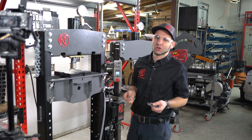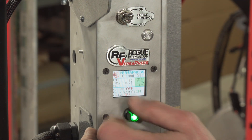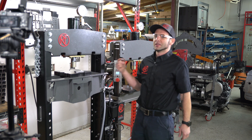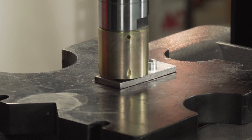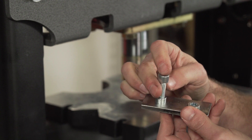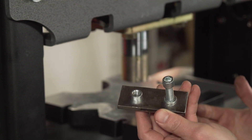The next size smaller than the half-inch one — a 3/8-16 — we use them all the time here at Rogue Fab. I'm going to do this one with force control, adjusted down to a one-ton setting, which is what we've found works well for this size. We'll run it until it stops. Next, we'll run one without force control. Obviously it threads in super nicely when done correctly, but it won't thread in if you mess up. The force control can help save your parts and also protect equipment and operators in certain situations.